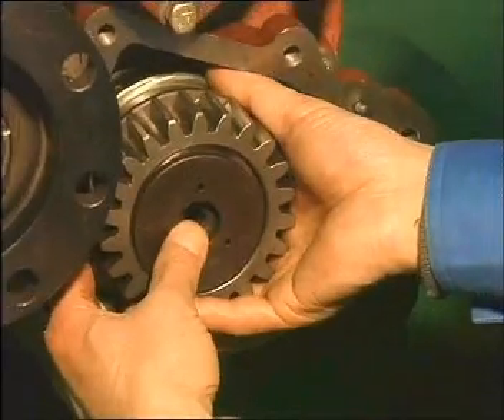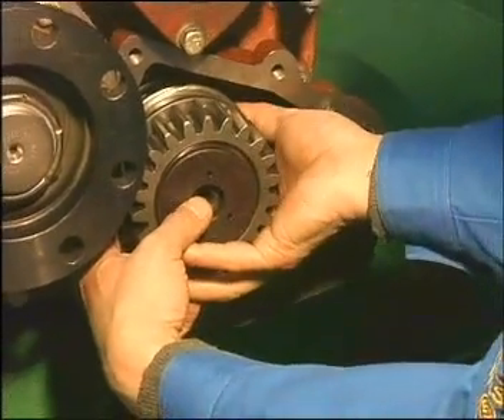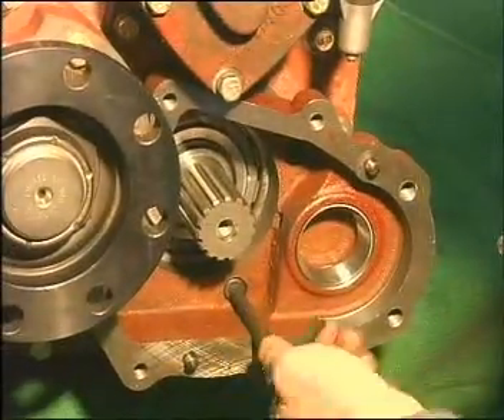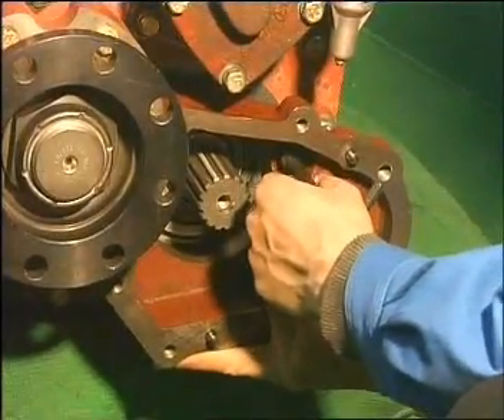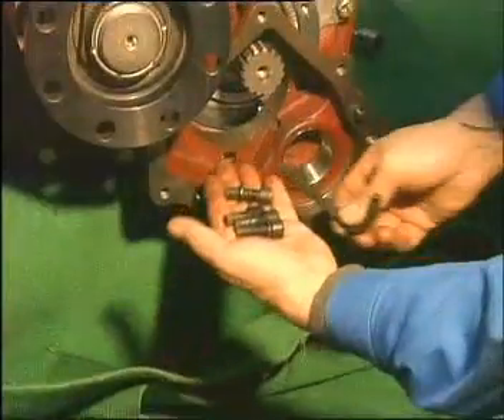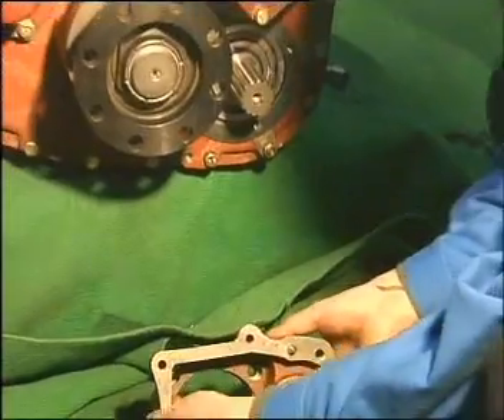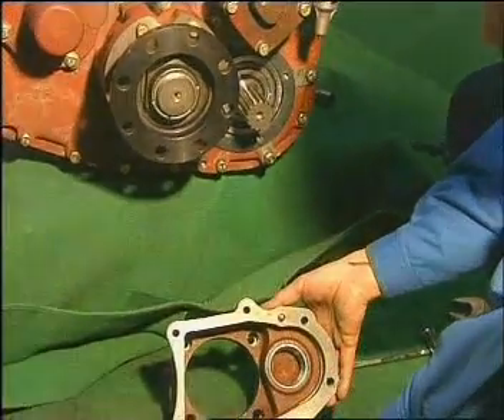Take the hollow shaft, mesh the yoke and yoke shaft compounding, take down two rolling needle bearings and input gears, loosen and take away the baffle and flange surface bolts, release the hex bolts and spring gasket compounding, then take off the housing of PTO.